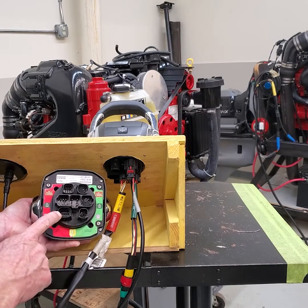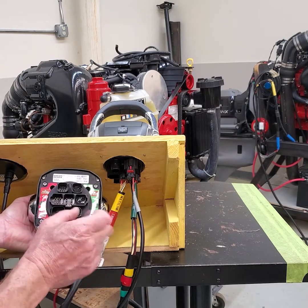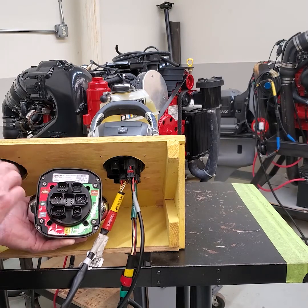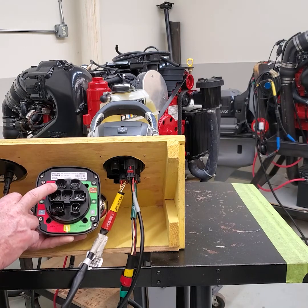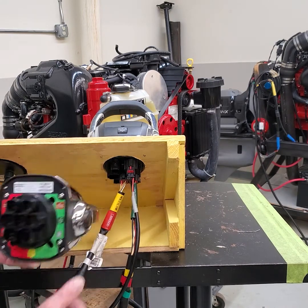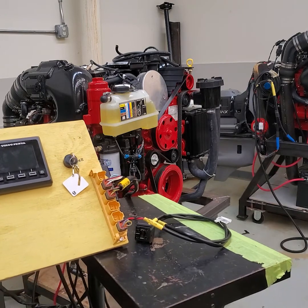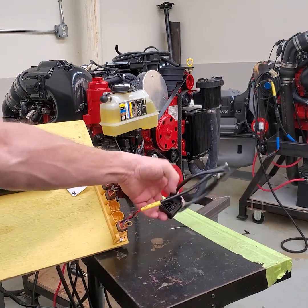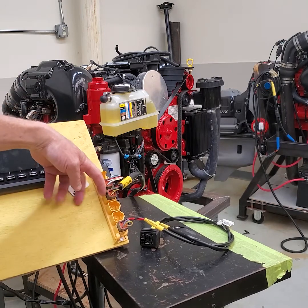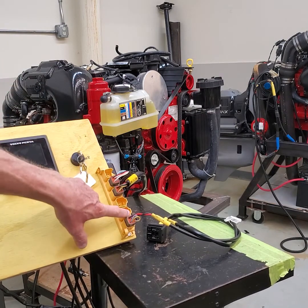The standard connections are on the bottom. You have your key switch; on the other side if you had a twin you'd have a six-pin key switch with a little adapter harness for that. You have your X2 data links for your two engines. Your X8 steering is left open because this is a single HCU — just leave it open even though it's non-functional on a single engine. In the center is your multi-link. The multi-link would be somewhere behind the dashboard, and basically it's going to be an adapter for a remote relay. You have your multi-link extension harness coming from the HCU into it, and then there's an adapter for a display — a NMEA interface can be here as well. There are a lot of options.